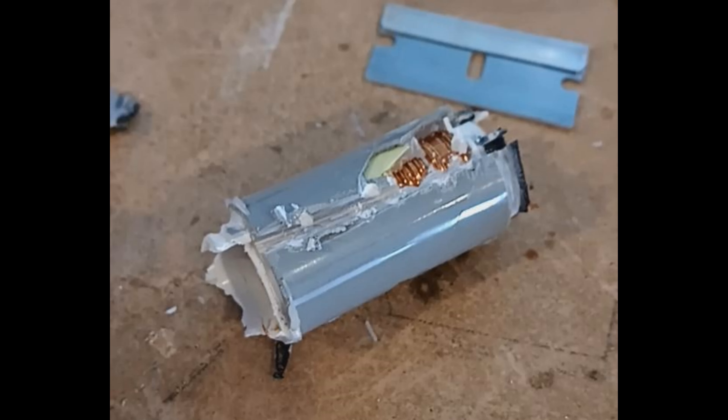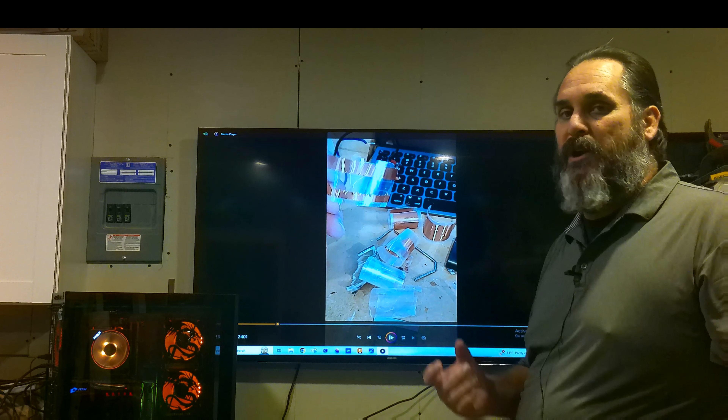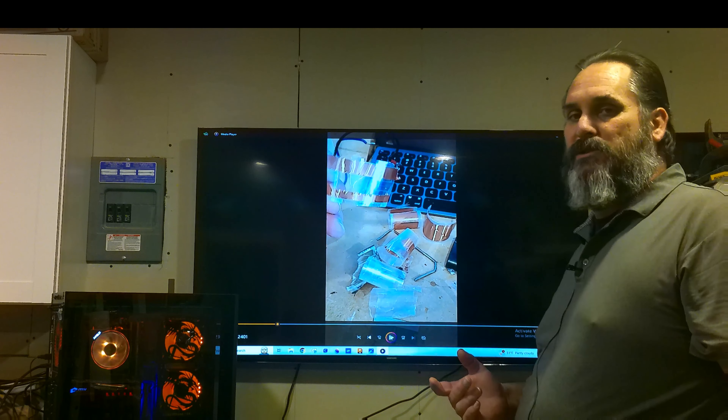You see the little lines here — just copper, copper plastic. This one's full copper; this one again is copper and plastic. This is your internal diode. This is why you can't find it, why most people don't understand it — most people don't tear it down this far to see exactly what's inside. This is what makes it DC: they internally rectify it with diodes. It looks strange, but let's take a little more look at it.